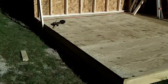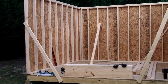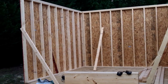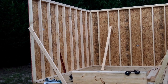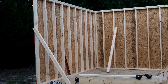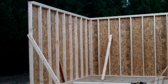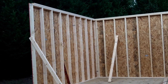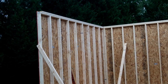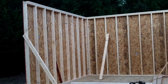Hoping this third wall on this edge here will also go faster. Here's the third wall standing. For the second and third wall, it's very helpful to have two or three people total — you can get it somewhat plumb and in place. I put those double top plates on, and apparently you're supposed to wait on those. I put them up with the double top plate on so they interlock, but it's a tight fit when you're trying to push the wall into the other wall.